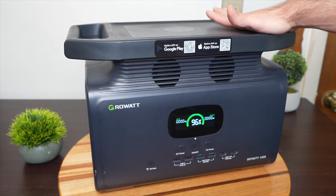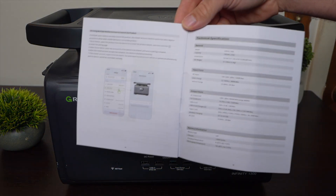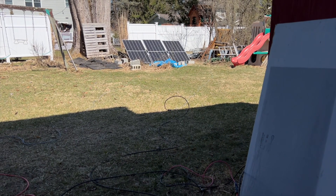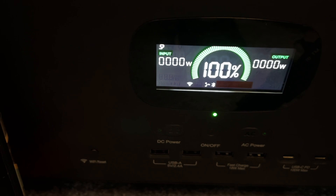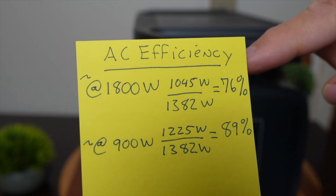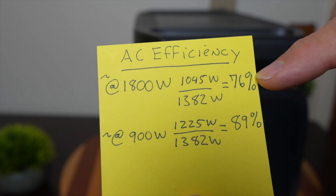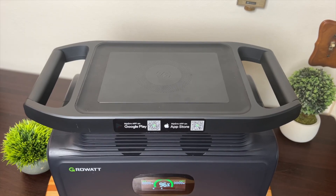Let's talk about the top five considerations when buying a power station. The first is: does it live up to its listed specifications? For the Growatt 1300, it performed as expected in all my tests. I was able to get almost 800 watts of solar input, do a full discharge near the 1800-watt continuous AC maximum, charge from 0 to 100% in about 1 hour 40 minutes, and get 100 watts out of the USB-C ports. A helpful test is measuring AC inverter efficiency. Running a full discharge near the 1800-watt maximum, the fans spun hard to keep it cool and I got 76% efficiency. With a continuous output of 900 watts from 100 to 0%, efficiency improved significantly to 89%.